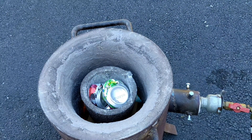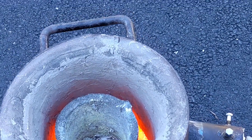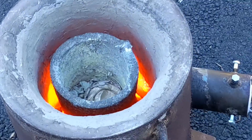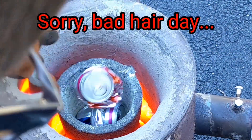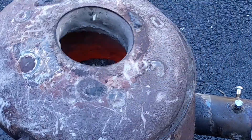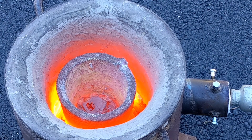But for anyone just starting out like I did, this is what I'd recommend you doing just to start out. When melting aluminum you need to get the temperature to about 1200 degrees Fahrenheit, but before you actually pour the aluminum the pouring temperature should be a bit higher, about 1300 to 1400 degrees Fahrenheit. You can see in the video these aluminum cans shrink down to basically nothing, so you really need to use a lot of cans to produce enough aluminum for casting.